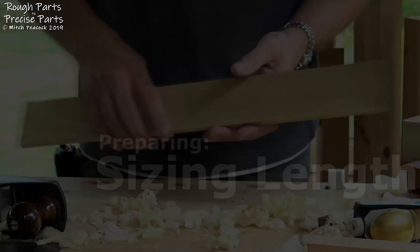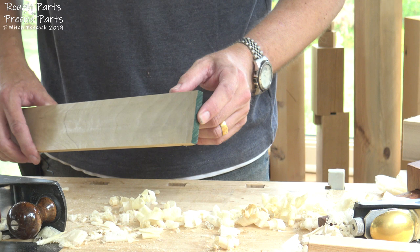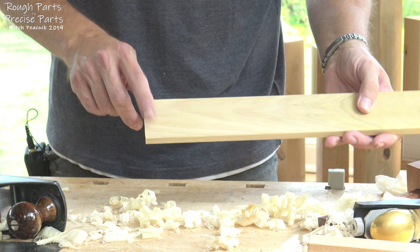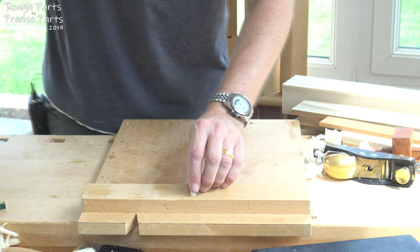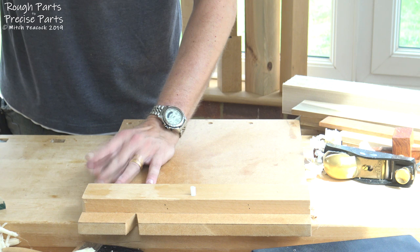When I was preparing the rough parts I did say I was going to leave them extra long, because at the end of the board where it's been seasoning you sometimes get some cracking, so we'll remove the majority of material from that end. First of all, let's prepare the other end nice and square. When I rough cut it I was aiming for square so I shouldn't be too far away — a few shots on the shooting board should deal with that. This is my micro-adjustable shooting board — the adjustment comes from just a little paper shim which I can slide up and down the fence to get me exactly square.